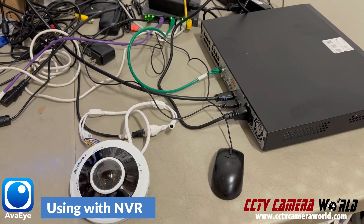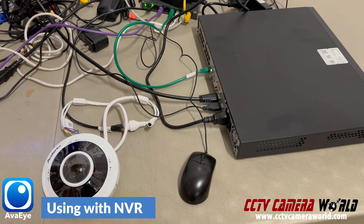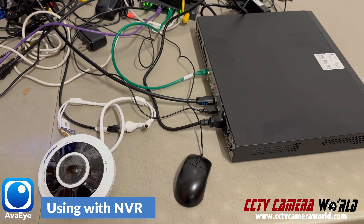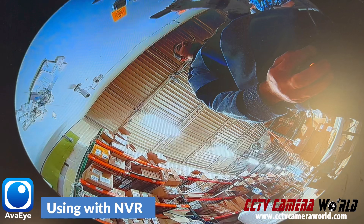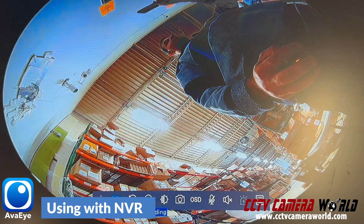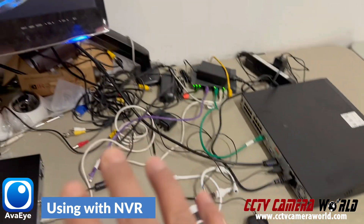The main purpose of this video is to show you how you can view this camera depending on what NVR you have. I've already made a video showing how you can use an NVR that has dewarping fisheye capabilities to view this camera. Now, this NVR doesn't have the dewarping capabilities through the HDMI port. I'll show you what that means — I have a mouse connected to my NVR going to a monitor, and when I left-click here I don't see that fisheye logo to split the view. I'll bring in a screenshot of what that fisheye logo looks like.